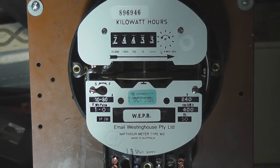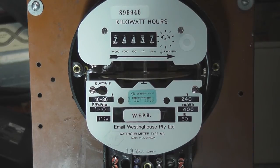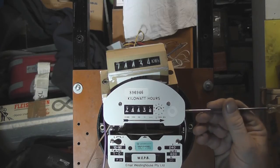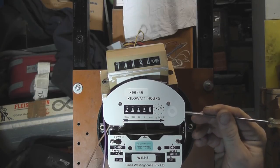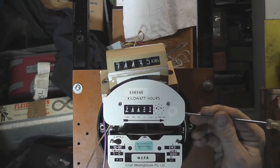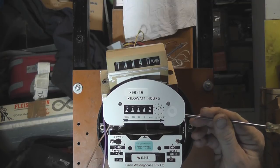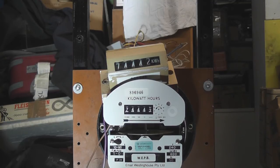To speed the process up a bit, I've unmeshed the register and I'll advance it to see how the remote dial goes. I'll get the remote dial nearer to the meter dial and flick through a couple of units quickly. As the meter advances, the register clicks over every unit.